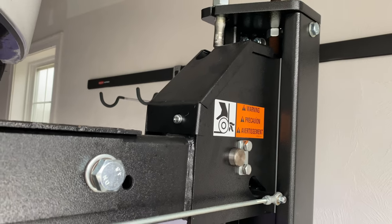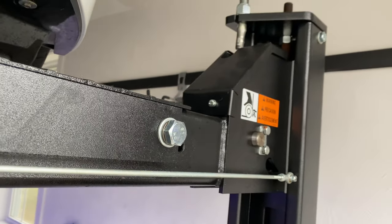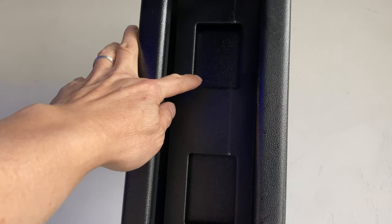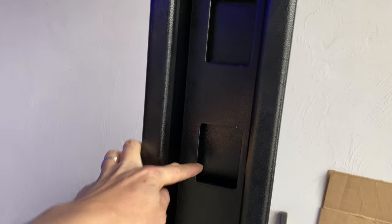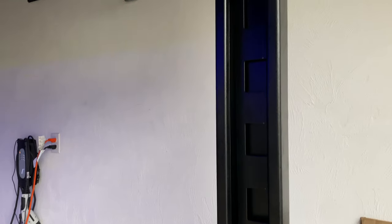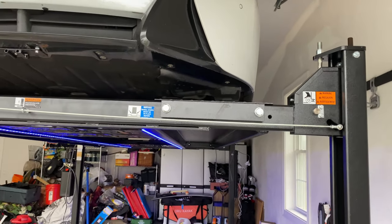This is the front of the lift. As you see, there are some covers right over here that I have to watch when you pull the car in. If you actually notice on this section, there are actually locks that the lift falls into for safety reasons, and I believe they are every 6 inches on this. This one is the Direct Lift 8S.